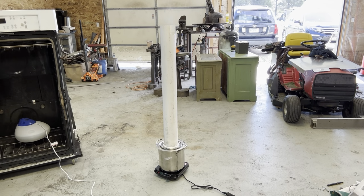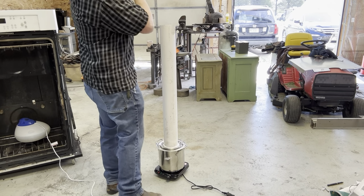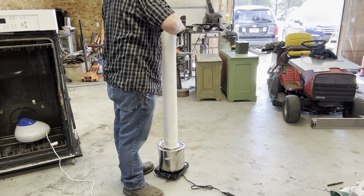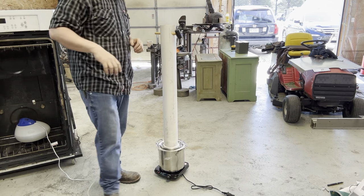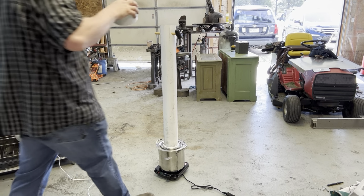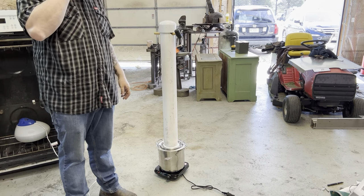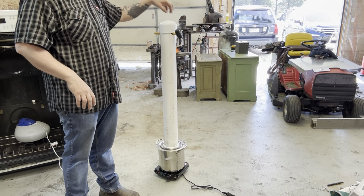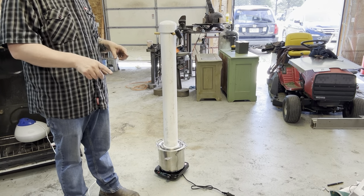So we're going to take our barrel, a rusted barrel. We're gonna lower it down inside of here. And we're gonna let that sit for about 1 hour, but I'm really guessing. So the goal is that when we take this back out of here, it should be black in color. We're converting the red oxide into black oxide.